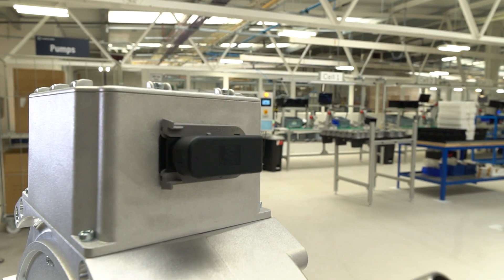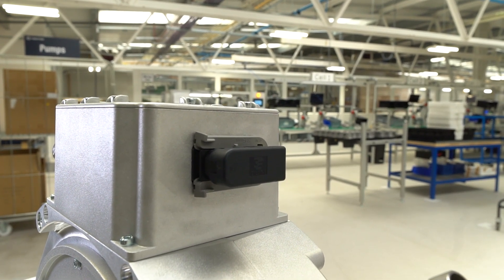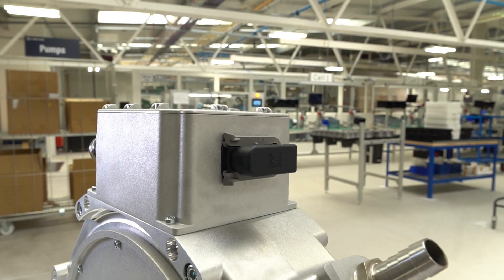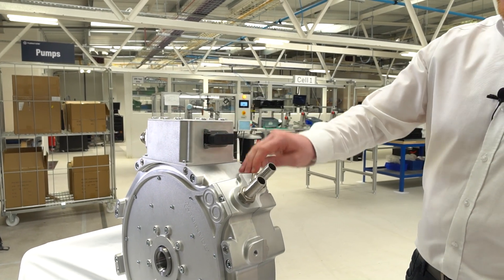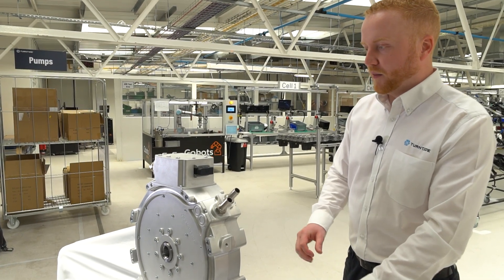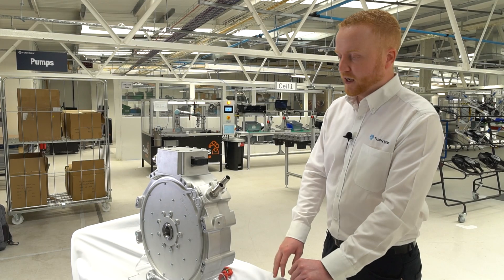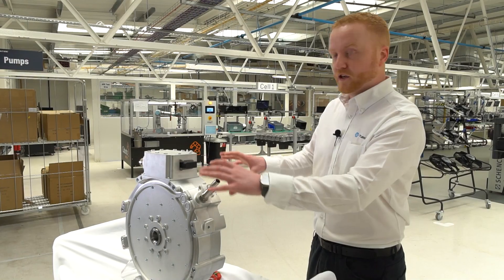At the top we can see the TE low voltage connector, used for providing signals from the PT-100s embedded within the windings for monitoring temperature, as well as for the resolver signals. We also have the option for a bearing temperature sensor, which can be fitted as an optional part. All major components — the two main housings, seal plates, top box, and lid — are cast aluminium, ensuring rugged construction. This means the motor is durable and doesn't require major adaptation or additional framework to integrate, and the customer can mount from both sides with bell housings, forming part of a continuous structure.